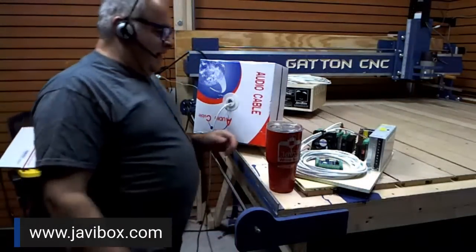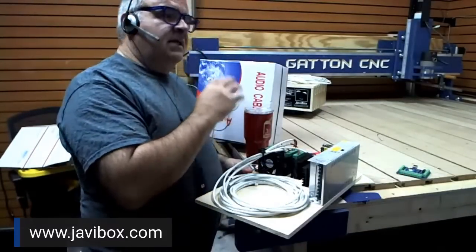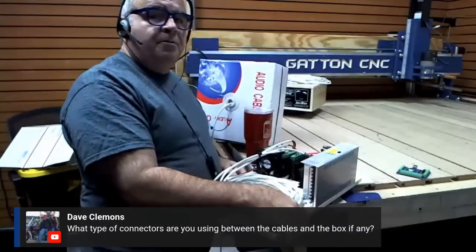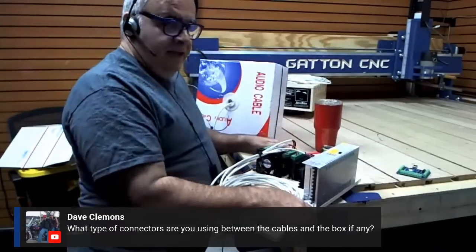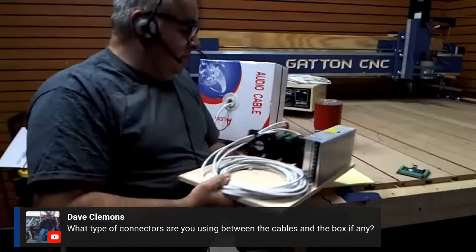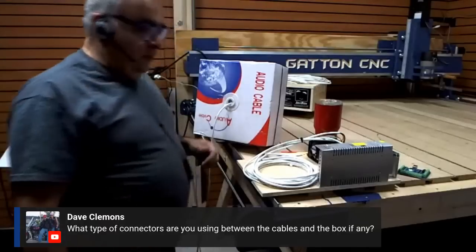That's it. You've got three choices. Option A, place the box in a comfortable location, or a location sealed from dust. You know, all it is is a few wires, so it's no big deal extending them. Option B, let the thing get full of dust, and good luck, which I don't recommend. Or option C, seal it completely from dust, so that all the little heat sinks on here will be effectively worthless, and you'll have a box that lasts you a week or two.